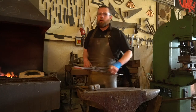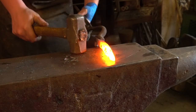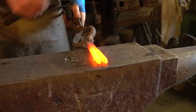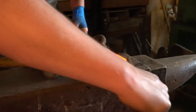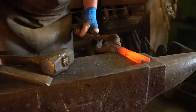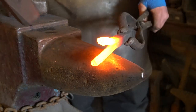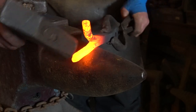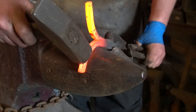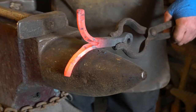I'm going to close this cut up where the transition is, then forge it flat. They've overlapped, which is not what I wanted — open them up a little bit. I'm just going to open these up on the end of the chisel — drop it in the hole, give it a twist. I need to open it up initially to get it on the bick; I need somewhere to get a hammer in there. On the next heat I can take it over to my bick, and because I've opened it up a little bit I can get in there with my hammer and just tease it round. Do the same on the other side, open that up a little bit more.